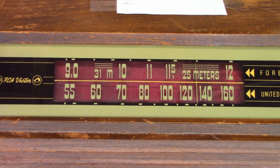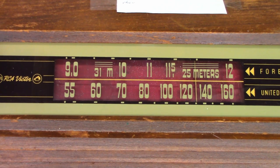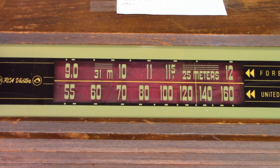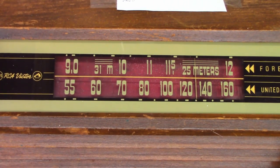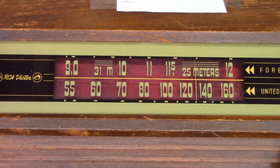I'm going to slip the case back on and see if we're close to somewhere between the 120 and 140 mark. It's reading like 1305 to 1310, and I'm supposed to be getting 1290 — that is pretty doggone close. I'm going to move the pointer about a sixteenth of an inch and then clamp it down. I have the radio turned sideways so I can pick up a station on the low end of the AM spectrum, and I show one coming in at just past 650. It looks like it's aligned perfectly for both the low end and the high end.